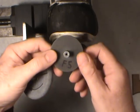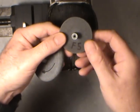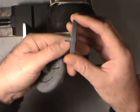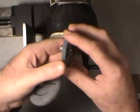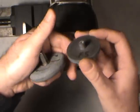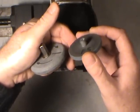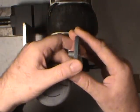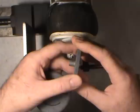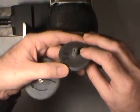If I just put, say, a 3 or any number without the F or the H, then I wouldn't have it adjusted to the right height. The figure skate being the thicker blade, and depending on how you dress the stone, the stone is also not going to clamp in the same area, so they each have to be adjusted according to the blade that you're sharpening. The figure skate blade is much thicker. That will change the height, plus the different grindstone that's in there.